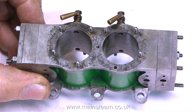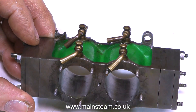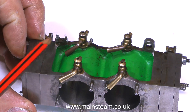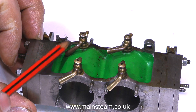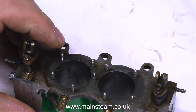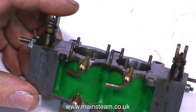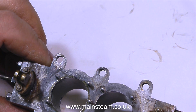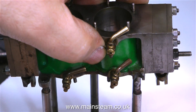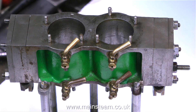Time now to look at the main cylinder block. This is a very important component and it looks okay on one side, but on the other side a lug has broken off. This is quite common and no real big deal, but the fix is difficult. I could take it to a specialist repairer and get them to weld it up, but that risks damage to the main cylinder casting. Thinking ahead, I can make this work by putting an extra piece of metal in and a washer to hold everything together. The structure has five of these lugs, and even the broken one rests on top of one of the columns.